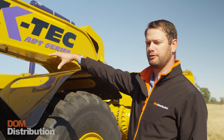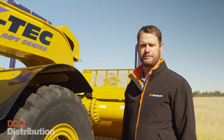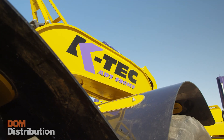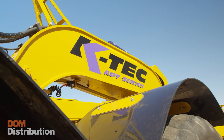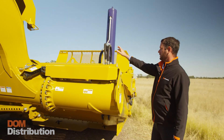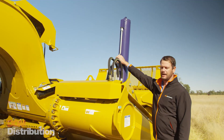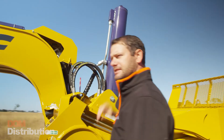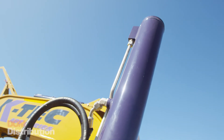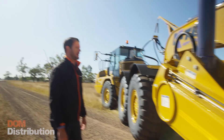On the front of this truck there's a swivel ball on the articulation, and that's one point that needs to be greased every day. After that you have the ADT neck — this truck is connected via that swivel, which comes down to the main trailing arms. With the trailing arms we've got the lift cylinders on the front. These lift cylinders have got a cushion port in the middle that allows suspension, so anytime the truck is moving and the cutting edge is over six inches off the ground it's automatically got suspension.